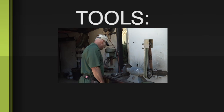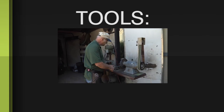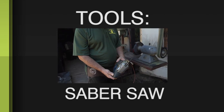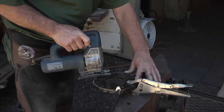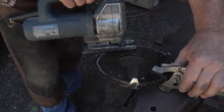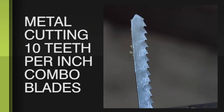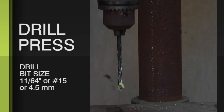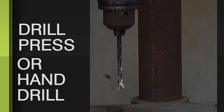The other tool that you're going to need — a lot of people used to have these for cutting out pads — this is a saber saw or a bayonet saw, handheld. Make sure it's an orbital one that sweeps the blade forward, and I use the special metal-cutting 10-teeth-per-inch combination blades. And then of course the drill press, if you have it set up, but you could also do these by hand with a hand drill.